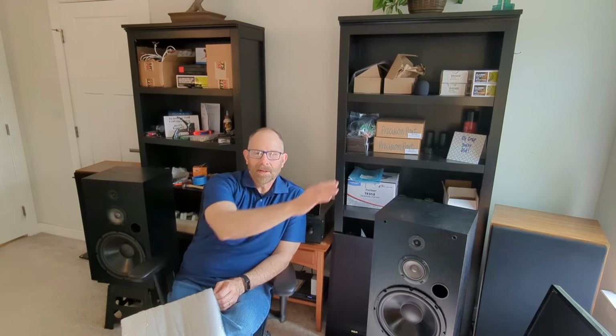So when your speakers can go higher than that and they're full frequency from 20 hertz to 20,000 hertz, great. But you're only going to be hearing back what's actually being pumped into them. There's not a whole lot of musical content at the 20,000 range or the 20 hertz range. Most of it's going to fall in between, give or take, say 50 hertz to 10,000 hertz, let's say. But it's important to get a nice solid bottom end. That's really what gives a speaker its warmth, its character, its signature. I mean, it's everything, right?